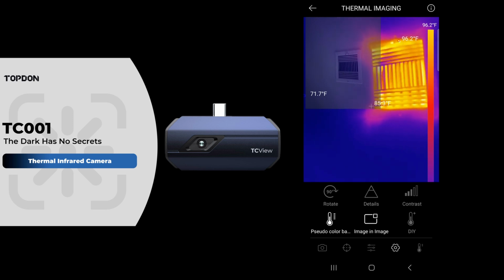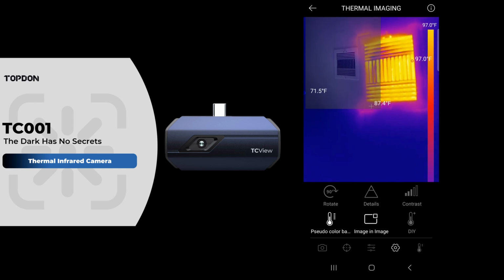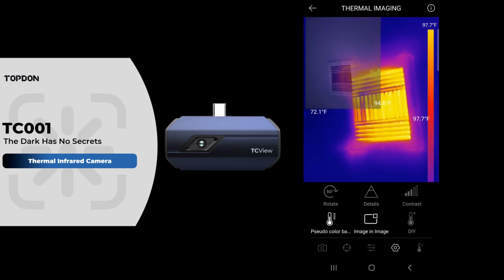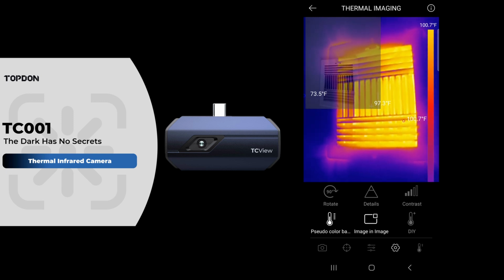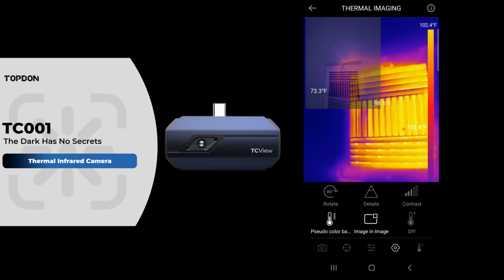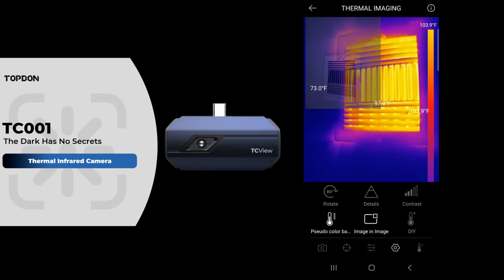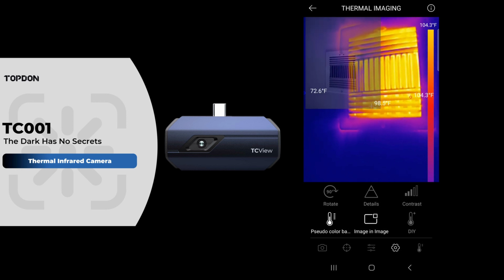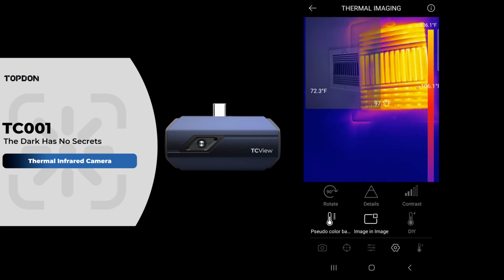The heater just kicked on, but you can see the vent illuminating in the background. I've got my imaging on here also, where I can actually see what my diffuser looks like. Right now we're blowing about 86 degrees out of there. Looks like 90-something. Let's see, I'll point that sensor right at it. At 99 degree discharge temperature. We're about 100-something right now.